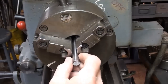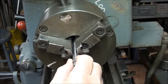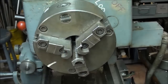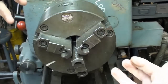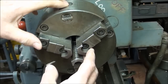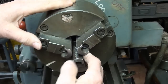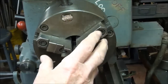The stock I was using here for my test is half-inch drill rod, so it's ground and accurate and truly round. I'm going to take that out now, but I also checked this with an indicator, and believe it or not, there was very little run-out, so we'll do that again later on. In order to grind the jaws with a tool post grinder, you must load them — that is, we must have pressure against them toward the inside, as if you were tightening it, not as if you were loosening it. I think they should be pre-loaded toward the center, as if you're tightening, rather than loosening them.